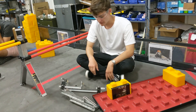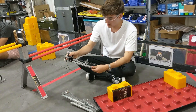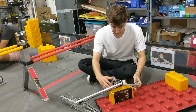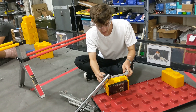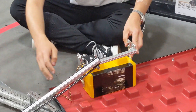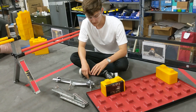Some flaws with this design right now: one trade-off is that the chain bar linkage is a little more flimsy, as well as maybe adding unnecessary complexity with the sprockets and the chain. Our gripping system also needs a lot more improvements — the gripping doesn't quite grab it in the center, it adds a little rotation and is kind of off-center. It's just not tight enough right now, so there's a lot more design that needs to go into the gripping system. But otherwise, this is an improvement over the four-bar design.